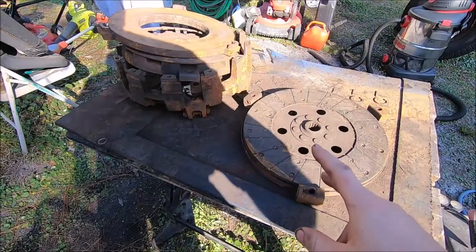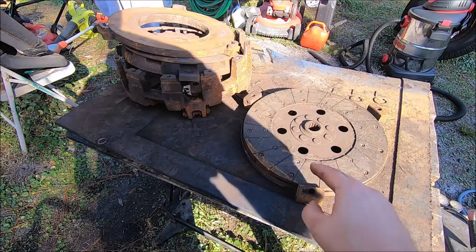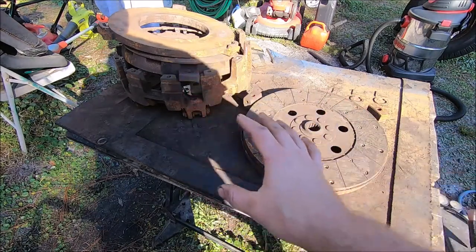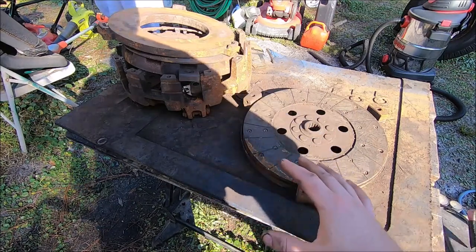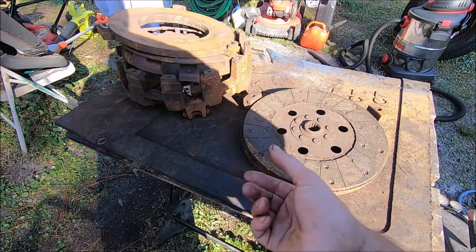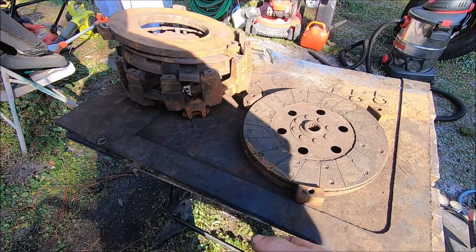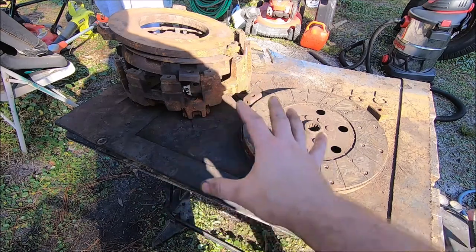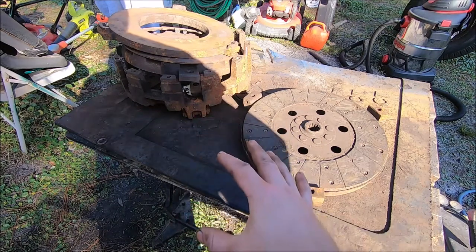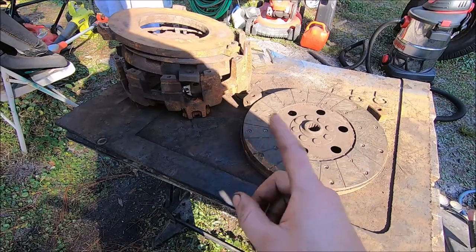The net result is that the clutch discs are within John Deere minimum specifications; however, the traction clutch is worn significantly more than the PTO clutch. There's a lot of clutch material dust and corrosion, which can be cleaned up. The clutch fingers ought to be replaced because they're worn unevenly — the fingers are different thicknesses. Considering the time, labor, and energy to selectively replace worn parts versus getting a new assembly, it's probably worthwhile to just put a new assembly in because it'll have more clutch thickness and last longer. We're going to contact the customer and see what they want to do.